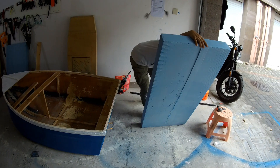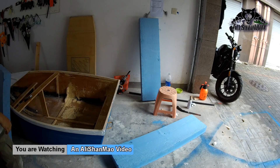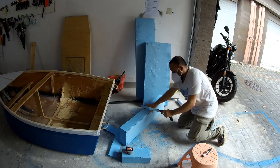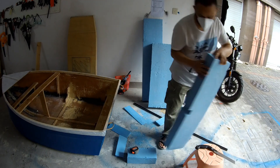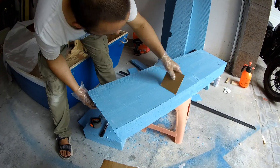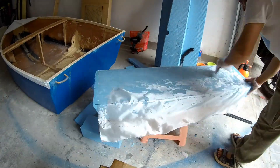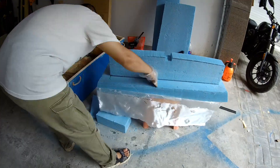Next I used the remaining foam I bought for building the DIY electric surf boat — that build video also needs updates coming to my channel. I used this foam to build the seat in a detachable way, so in case of emergency you can hold on to it since the foam seat will float and act as an emergency floating device. If anything goes wrong, the seat is easily detachable and acts as a life-saving flotation device. It's a good idea so I'm not going to fix this seat permanently. One layer of fiberglass with AB epoxy finished it very nicely — I used a fine weave cloth and the seat turned out great.